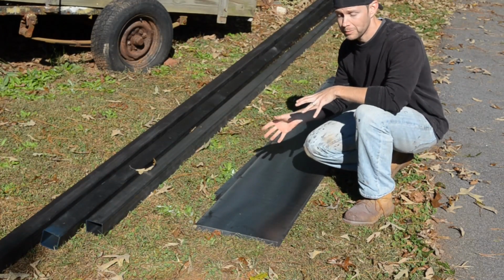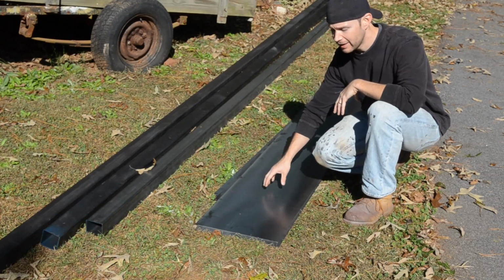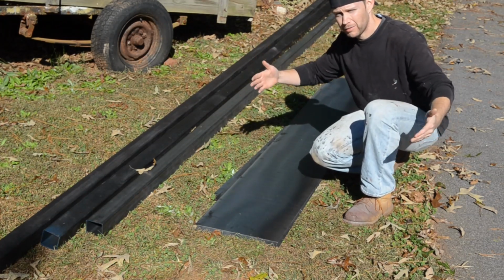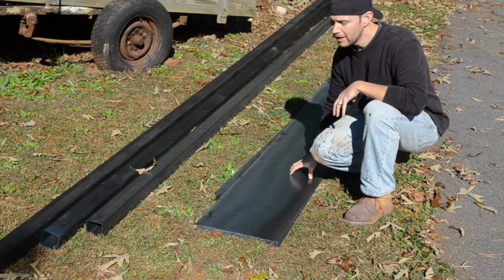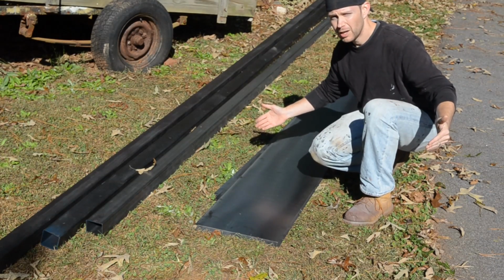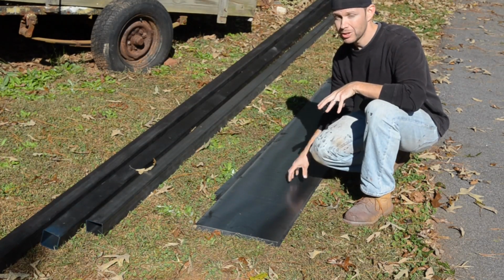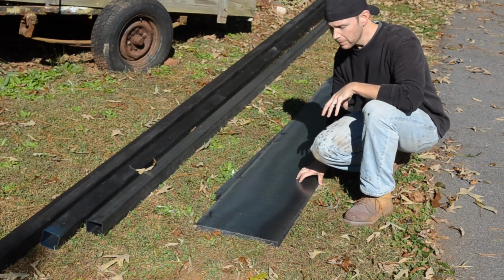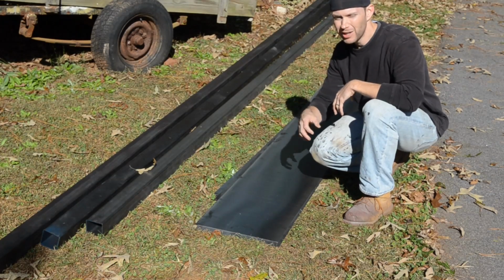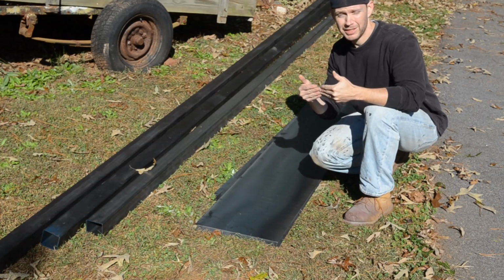Here's the material we ordered from King, and I went ahead and got the sheet metal sheared to the size that I needed. I got this sheared at 15 inches wide, and the longest section is going to be 8 feet, which is going to be the ends of my dumpster. For my other two longer panels, I had them sheared into two 7-foot sections, because it's about 14 feet long, and that's going to allow me to weld down the center of where one of our braces is. I'm going to show you exactly what I mean very soon. I just planned this out so it'd be easier to weld together, instead of trying to weld two pieces of sheet together where there wasn't anything else joining, which is easy to blow through.